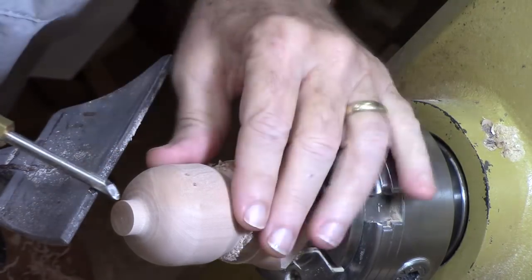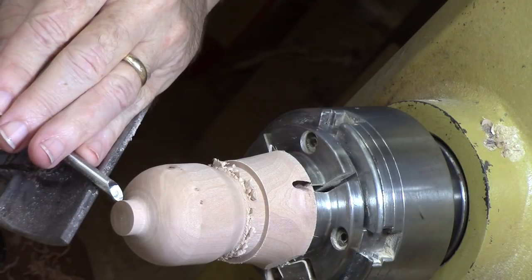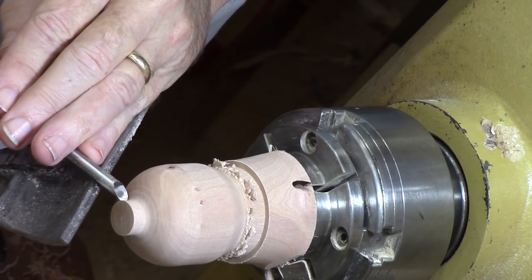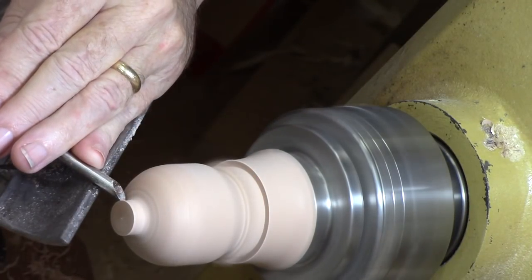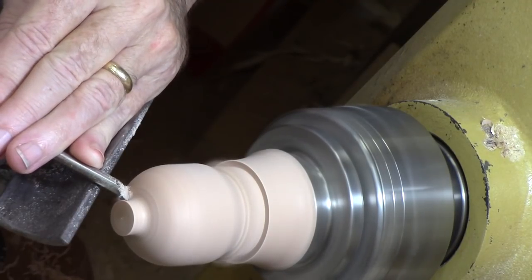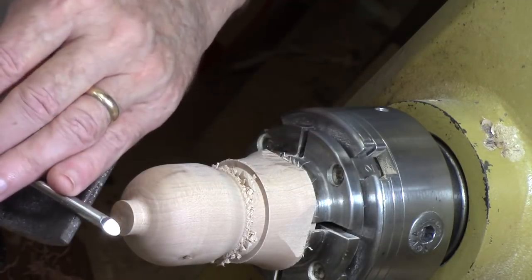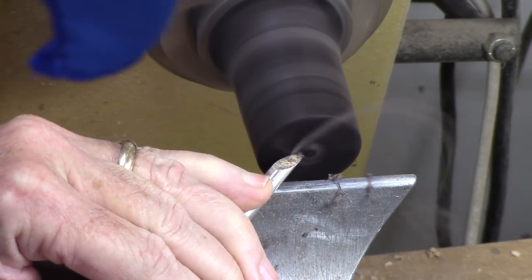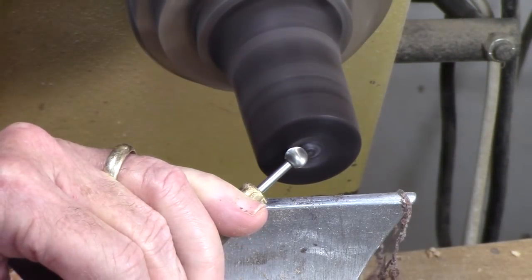On a recent video showing this little piggy, Jim Robb, a viewer from Scotland, reminded me of his little cove tool, which I showed in a video on small round lathe tools — I'll have a link to that playlist at the end. This tool works really well for tiny little coves where it might be difficult to get in. I do use this little cove tool quite a bit, especially when using the Dremel texturing tool, as I show in this clip, to make a little cove for the burr to roll in smoothly.